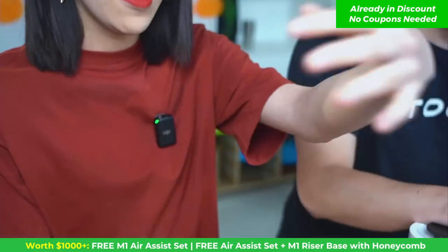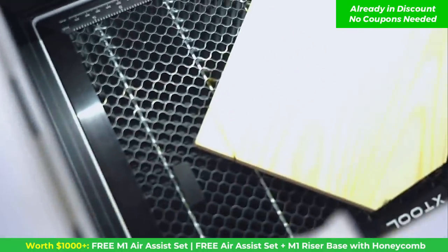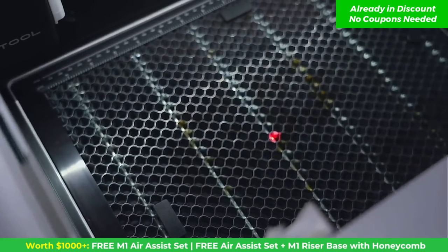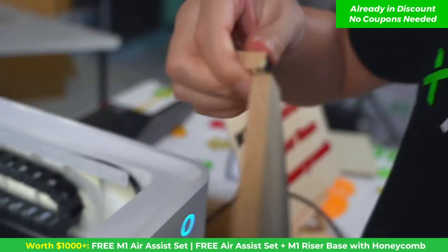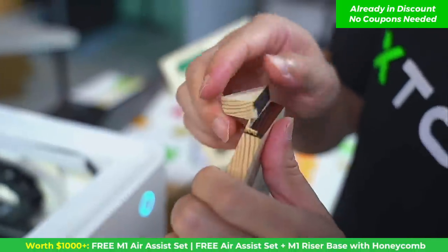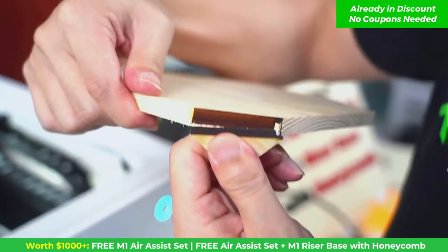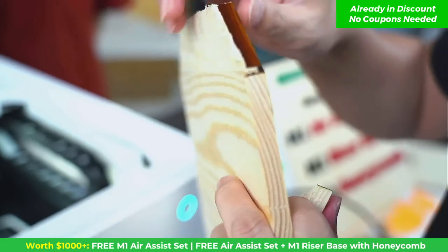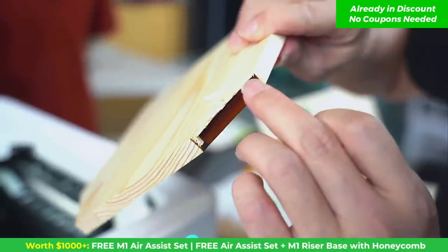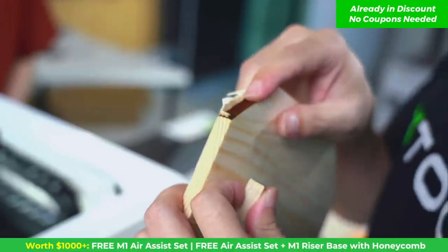And the project is done. We can move back to see if it cut through. I will take the material. It's not cut through. Okay, I think this is the max cutting ability of the 10 watt, actually I think it's 9. So we can see there's a little space that we cannot cut through, and that depends on the material. On this material you can see we cannot cut through here, but the cutting edge is very clean. Oh, I see, it's very smooth.